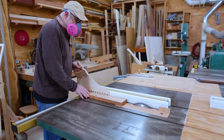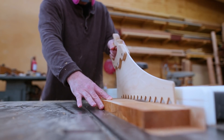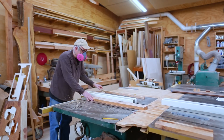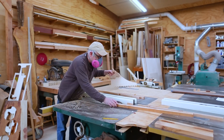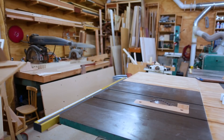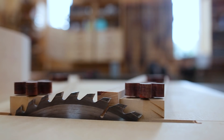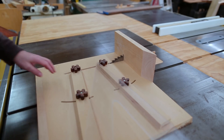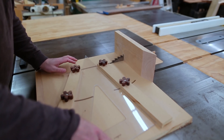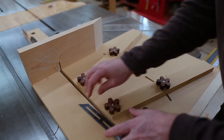I joined it and planed it and got it down to about a 1-inch dimension, then I cut square strips from that cherry. I'll make the main body of the ball out of stacked-up rings, so I can use these strips to make those rings. I have a sled that has two fences on it for cutting the segments for the rings — the idea is that the angle for the segments is the difference in angle between the two fences.